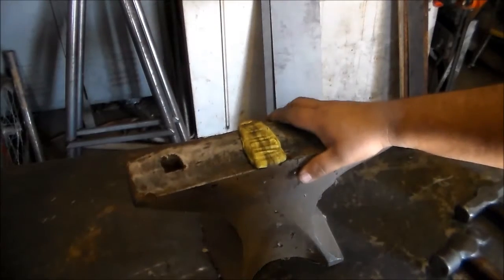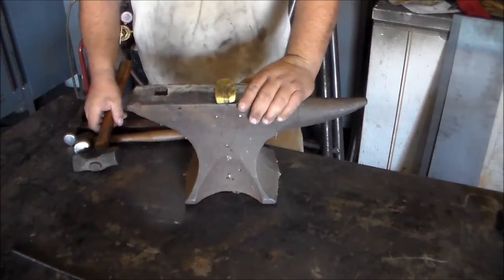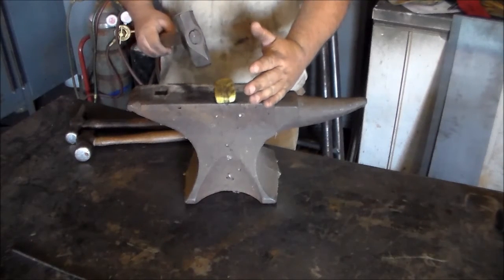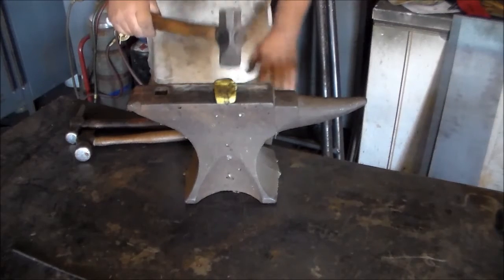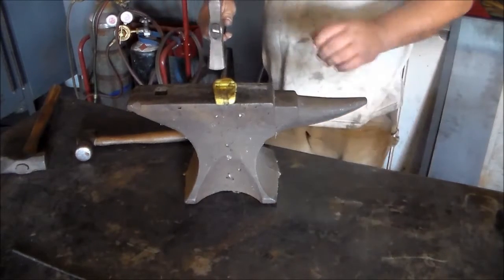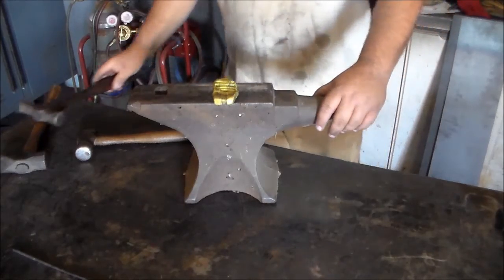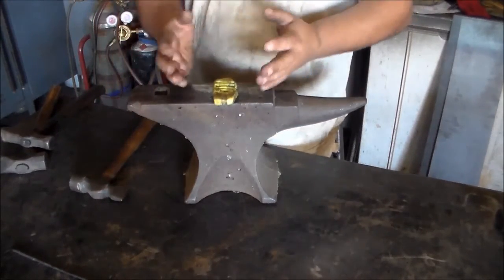By the way, this is my daughters' play anvil when they come in the shop — they can kind of play blacksmith. This isn't for actual use at all. You can see this little anvil here and you can see where I'm standing and see my arms — I just want to show you with both of us in frame how this would work. With the diagonal peen, it's natural kind of standing straight onto the anvil. Whereas when you're using a cross peen, instead of being able to stand straight on, you have to move around to the side a little for it to be at its natural position where the hammer falls naturally. And with the straight peen, I find it easier to move the other direction and use it. So that's the difference in the directions of the peens.